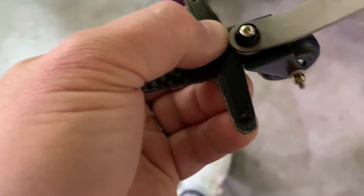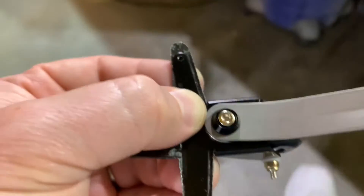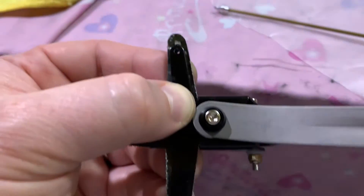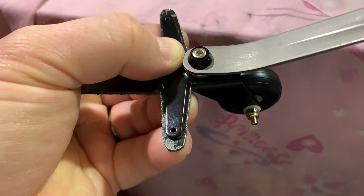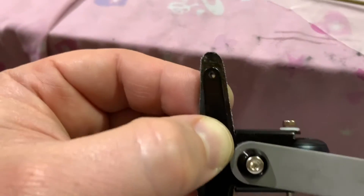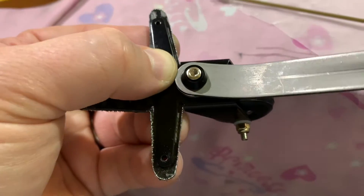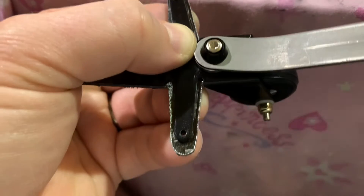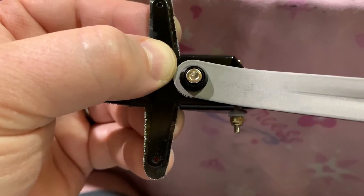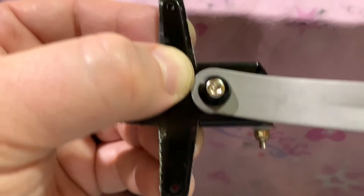As I mentioned before, we use two pieces of carbon fiber sheet that are laminated and epoxied together. I'm holding the tail wheel in this fashion because I used the metal bracket that's part of the tail wheel as a template to shape and refine this bracket that's going to attach to the rudder. I also used the holes on the metal control arm on the tail wheel to make sure we got the spacing of the holes correct, and it matched.